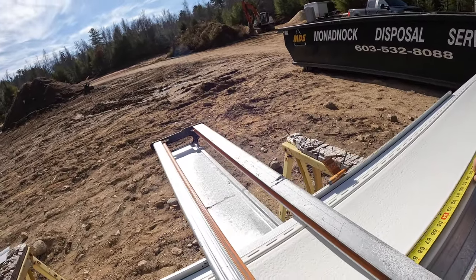So now what I'm going to do, my ladder set up. So I'm more than 8 inches away. Get my next piece ready to go. Just laying it up there, and push this to the top. Now you can see all my nails are centered in the slots. And I'm just going to let this nail be a little bit down. That way the piece will eventually just slide down and rest on top of that nail. Again, it's near the top of that slot.